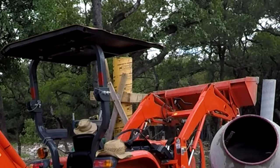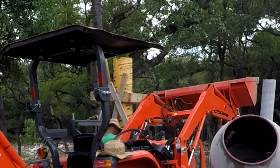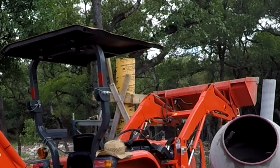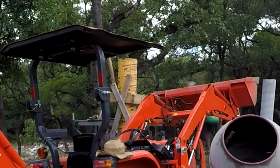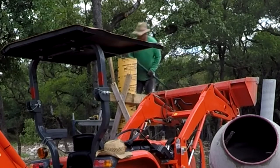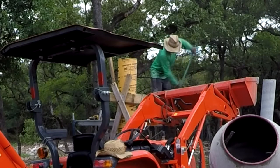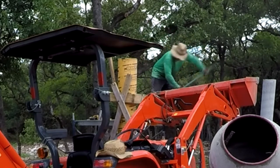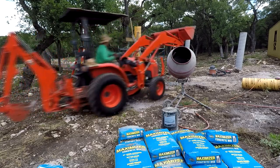This concrete process is interesting. You see me redoing the level of the tube — I support it with two-by-fours. When pouring the concrete at the beginning I have to make sure it's still level and in the right place, so you see me resetting it; it was moving quite a bit. I'm shoveling dirt at the bottom of the sonotube so it'll keep the bottom from moving around. You can see it vibrate a little bit initially when you start filling it up, then it becomes nice and solid. Then I'll laser it for the height of the metal support going in the top.